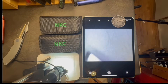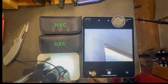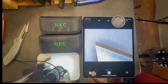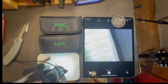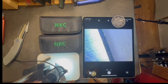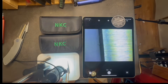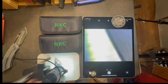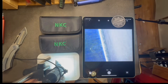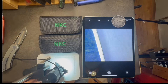Here's a look at mine — a little dirty; I've been using this knife and carried it for a week. It's the first time I'm looking at it under the microscope since I started carrying it, and I'm noticing there's some kind of scratch on the secondary bevel. What looks like chipping at the apex is not chipping — I think mine was slightly under-stropped and some of the sharpening burr was left on the apex, and now it's coming off as a wire edge pulling off on a regular basis. On the viewer's knife, you can see a much more pronounced convexity right at the apex, meaning his was stropped better than mine.